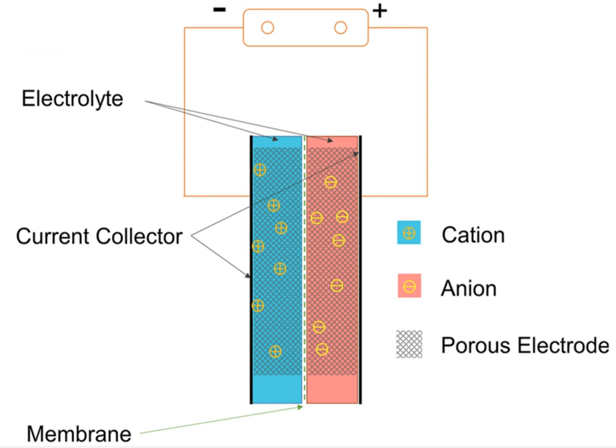Researchers have created a carbon aerogel electrode with gravimetric densities of about 400 to 1,200 square meters per gram and volumetric capacitance of 104 F/cc, yielding a specific energy of 325 kJ/kg (90 Wh/kg) and specific power of 20 W/g. Standard aerogel electrodes exhibit predominantly double-layer capacitance. Aerogel electrodes that incorporate composite material can add a high amount of pseudocapacitance.